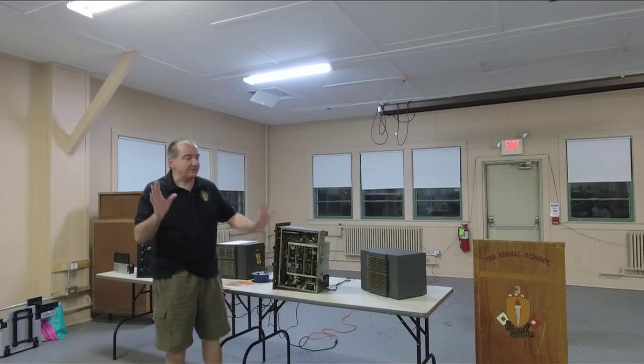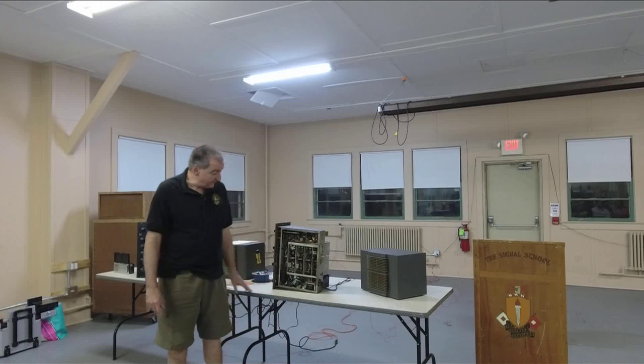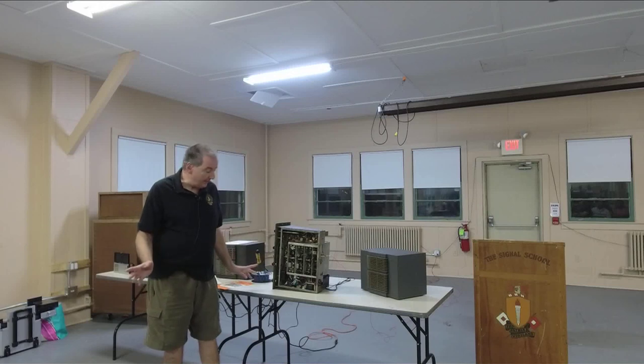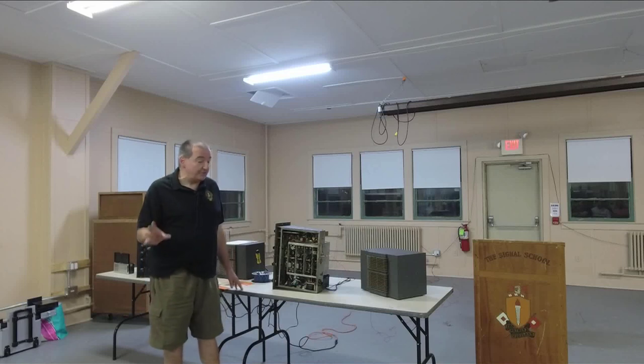Oh, also, this is the kind of stuff we find. Your problem, what's this red wire do? I wondered the same thing, so I disconnected it. And I was greeted with a hum from the speaker, and the thing didn't power up. And I'm like, holy, don't tell me somebody's got one side of the line going to the chassis. No, fortunately not. It actually was powering up, but only the rectifier tube was.